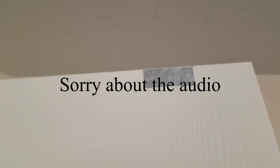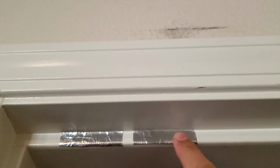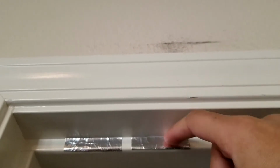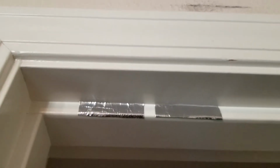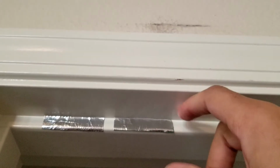And now I got all of the metal pieces on the door. I need to find a way to connect 5-volt to this one and pin 11 to this one. I'm probably gonna have to strip a wire so I can get it thin enough to fit in the gap between the top of the door and the bottom of this shroud. I realized something. There's a gap between this back and this shroud, so it won't actually be making contact when the door closes.